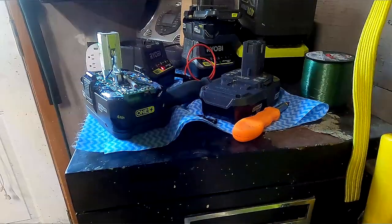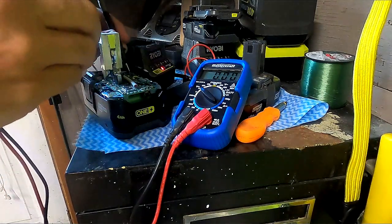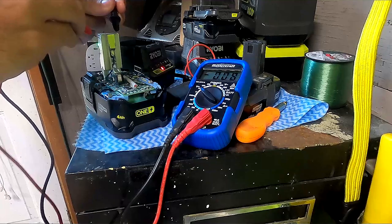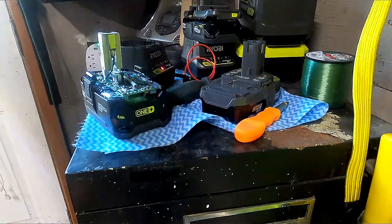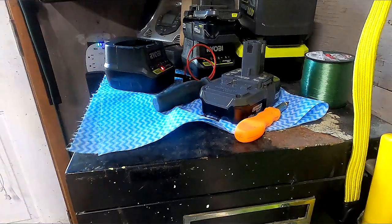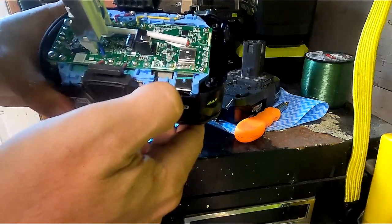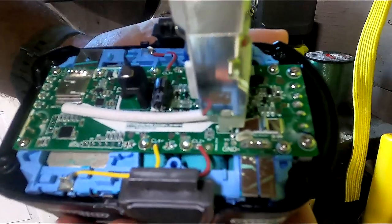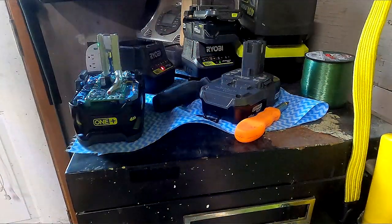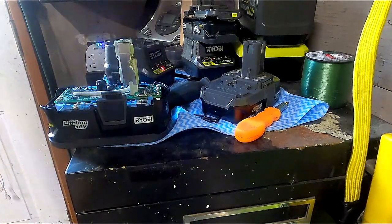When the battery reaches a voltage that's too low, it's unsafe to charge and could blow up, so it won't charge - hence the problem. Let me show you the voltage. At the negative and positive pulls on the bottom we're getting 5 volts, but at the terminals on top - positive to negative - we're only getting 0.8 volts. Because we're getting such low voltage at the top terminals, the system will not charge. This positive terminal isn't labeled, but this one is labeled GND - ground.